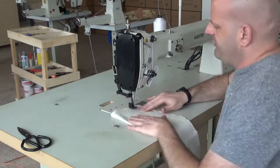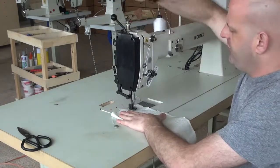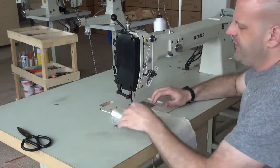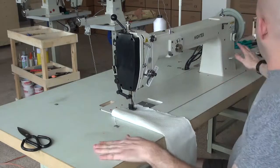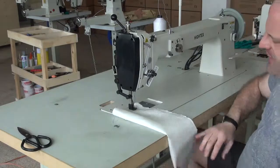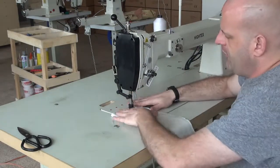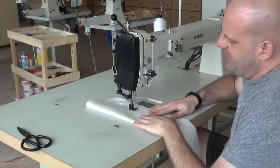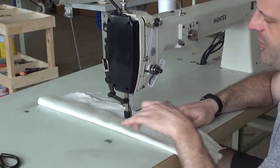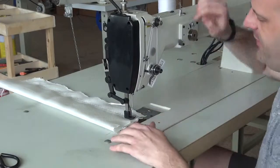Now I'm going to do some demonstration of sewing with this machine. We'll start out using the walking foot mechanism, and then I'll lift up on the presser foot to show free sewing as well. I'm starting with a couple of layers of relatively heavy canvas — the type used in bulk bag production. We have the machine set to run around 1,500 RPM, though it can run faster. As you can see, it keeps very nicely and evenly.